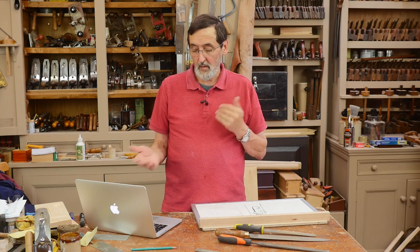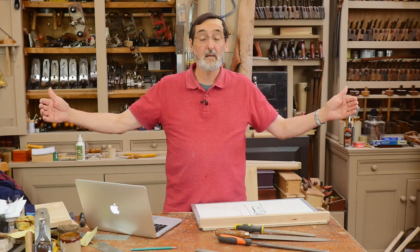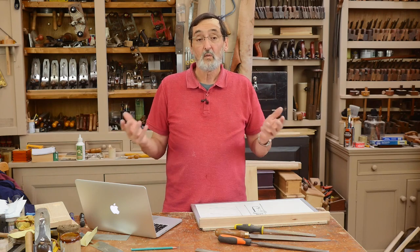On a tabletop, you're saying laminated tabletops. Laminated tabletops go back 200-300 years. I think it was very common, and we have very good glues today that do last, but even the animal hide glues, the oldest glue in the world, did hold up to lamination. So we do use it to get that expanded width. Otherwise, we wouldn't be able to do a solid tabletop 3 feet wide. So we do have to rely on laminations.